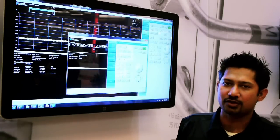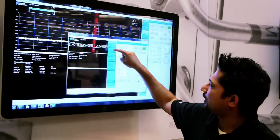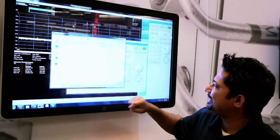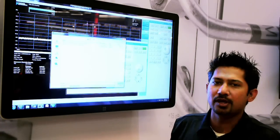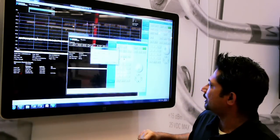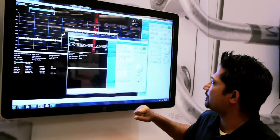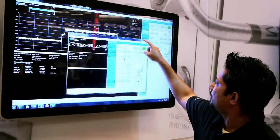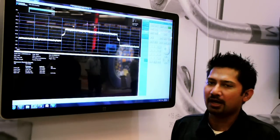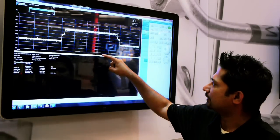And for my softpanel for the 5673, I'm actually going to go in and load an IQ file, a TDMS file, and we ship with WCDMA and LTE. I'm going to select LTE, click on OK, it detects the IQ rate, and click on OK there, and you'll notice on my spectrum analyzer softpanel, I'm looking at my LTE signal.